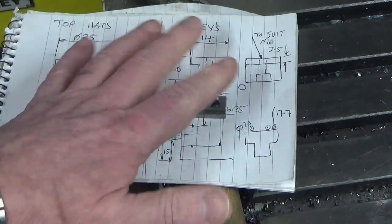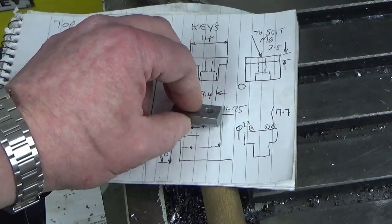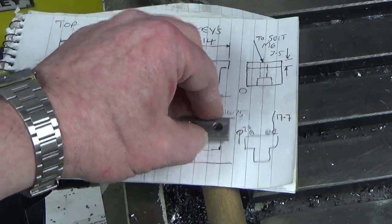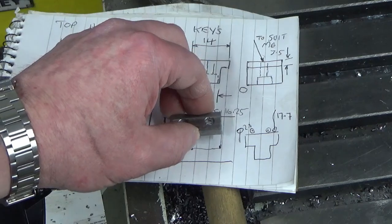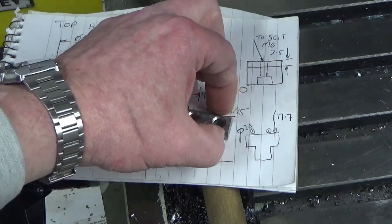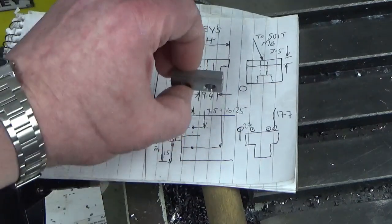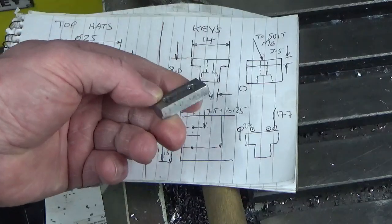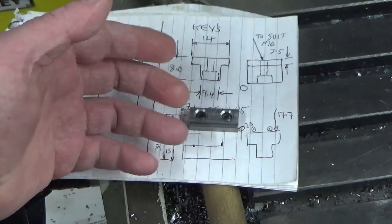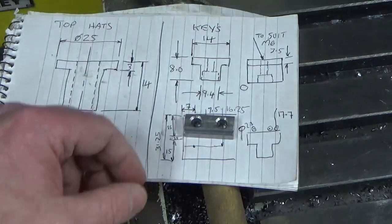And I thought, okay, I'm happy with what I've got. I'm just going to lay this in the table first. So I turned it this way up, got a really nice press fit into the table slots. So that's great that way around. And then I thought we'd try the vise, tip the vise upside down to try it on the thicker section in the slot on the vise, and I'm pushing and pulling and pushing and pulling, and not a chance of that going in. So I got the mic out, measured 14, yeah, well, I've hit that within 20 microns, so what's the deal?